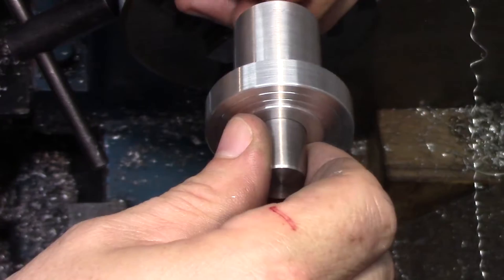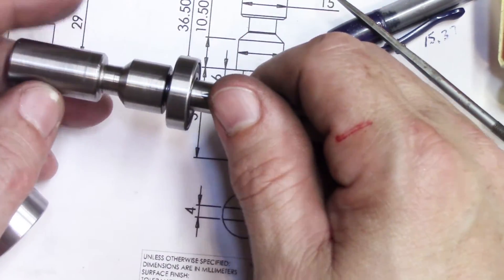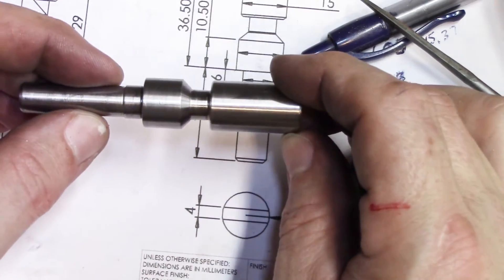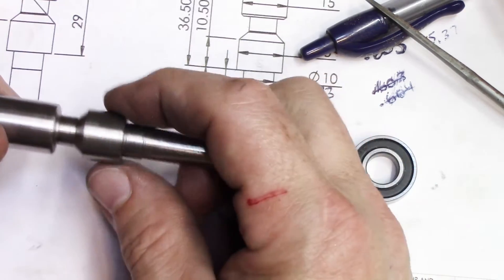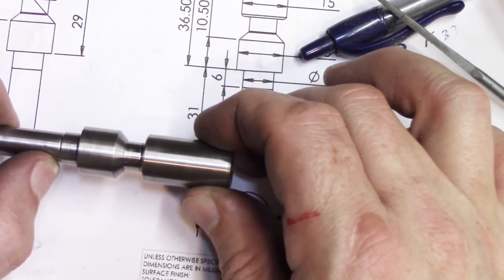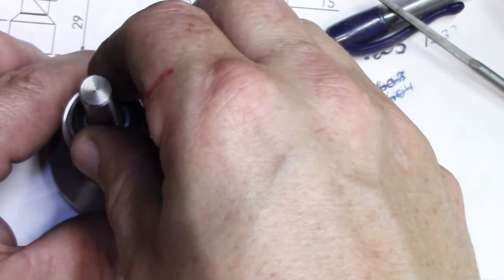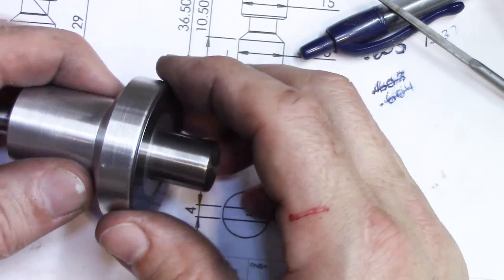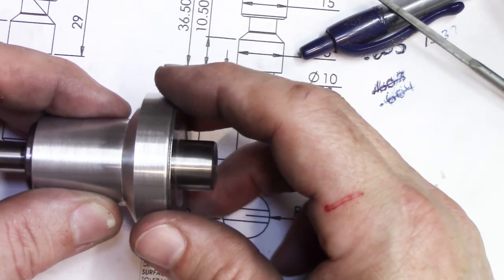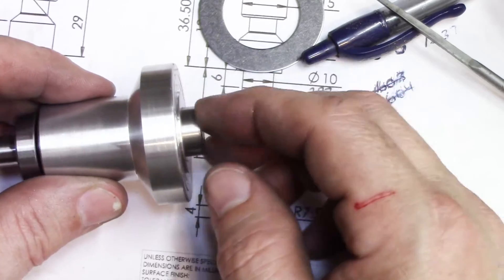Sometimes you have to work with what you've got, and what I have is a little bit limited on tooling and limited in stiffness of the machine. If I were to do this again, I'd put the shaft between centers and turn it that way. The only reason I didn't go ahead and do that now is because I was very close - within two or three thousandths. Putting it in a collet chuck, which is the same collet chuck I'm going to be using this tool with, I think that's got me there. Getting this within a thousandth with my machine is more than satisfactory given the limited rigidity, and I'm not making excuses for the machine - there are my own mess-ups in here too, but we're good.